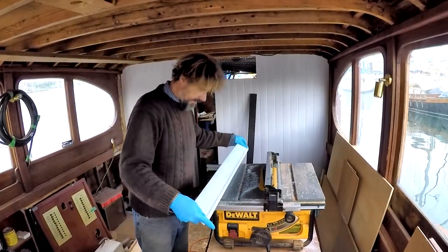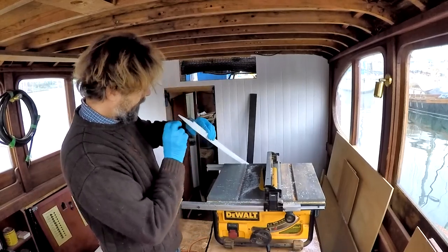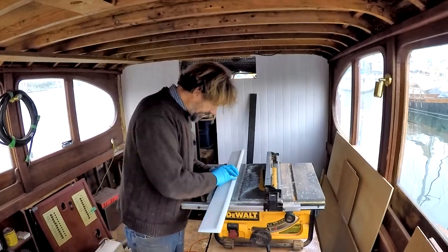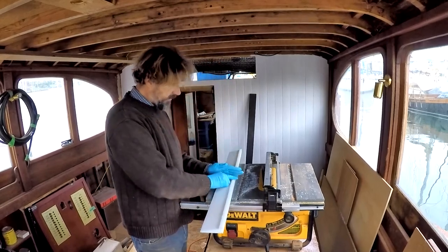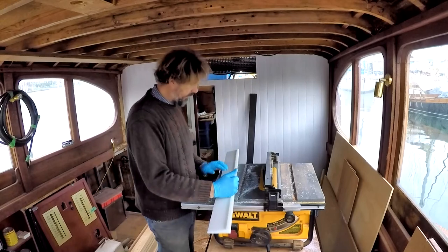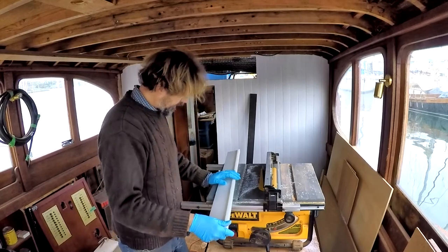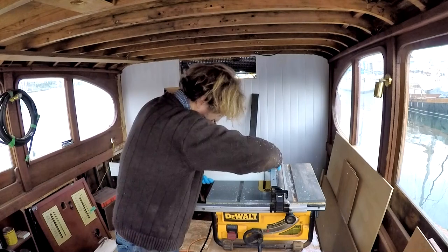This is time to cut a drip on the outside edge, and I have to figure a way to cut a trough for the inner glass, which is going to be on the inside edge of this, that can stop abruptly, because I don't want to cut a trough all the way along, because the window's never going to move and I don't want to have water sitting in it. Now, I could do that with the router table, but I really don't want to set the router table up just for that. I have to think about that for a second.